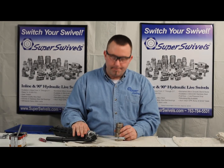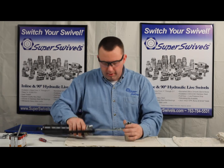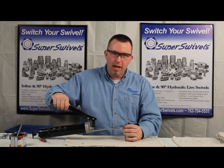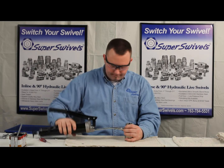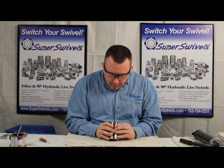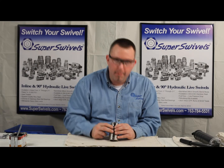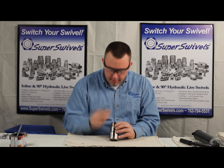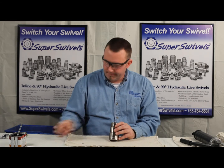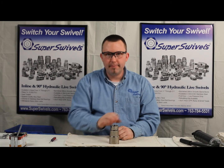Now it's ready for grease, but we want to be very careful not to over-grease this fitting. If you over-grease it, you can damage the seals and pretty much destroy the work you've just done. Give it about an eighth of a pump of grease — you don't need any more than that. The end of the greaser has a little check ball; once you have grease in it, you can just depress it with your screwdriver or a paper clip to release any excess pressure. Make sure that it turns, and you've got yourself a brand new fitting. Thanks for watching.